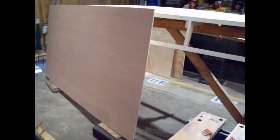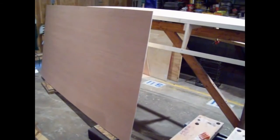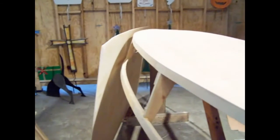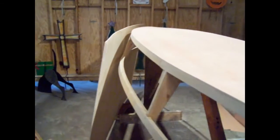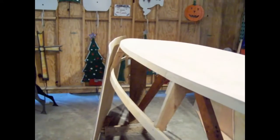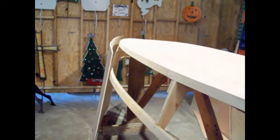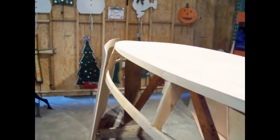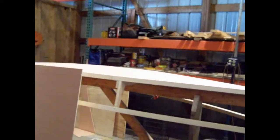When you're cutting these boards they're going to have a little bit of a radius to them. So I got blocks on the bottom to get my board about a half inch or so of excess on the top. Then I'm just going to give myself a pencil line on the bottom so I know better where I'm cutting, instead of cutting a straight strip and chancing it not fitting because of the radius. There's not a huge radius but from the front to the back of the boat it's probably two inches high in the middle of the bottom, so wish me luck.